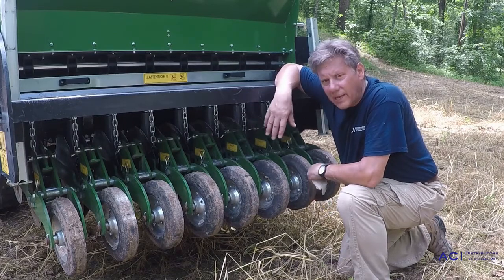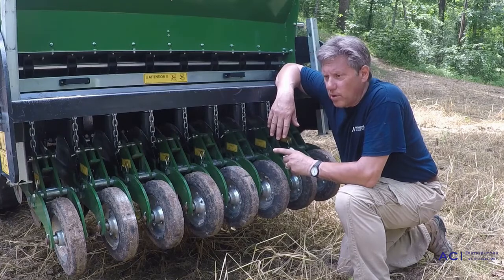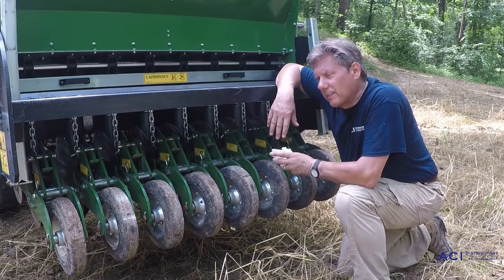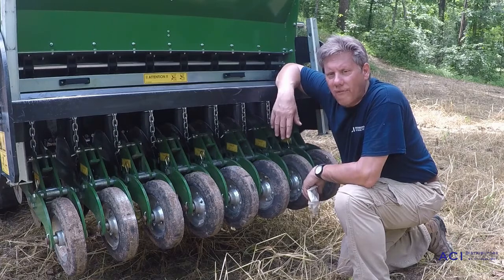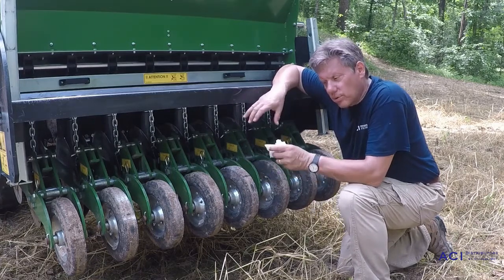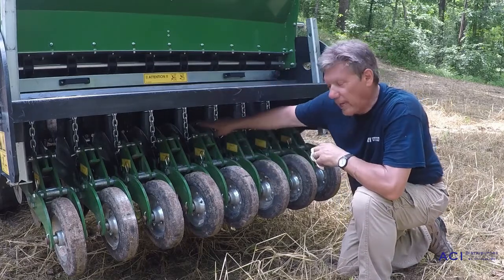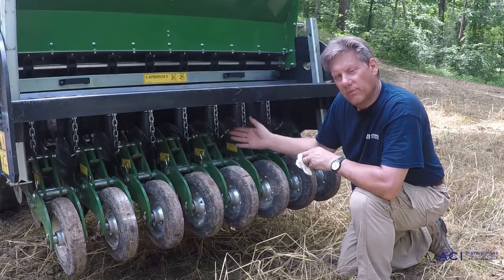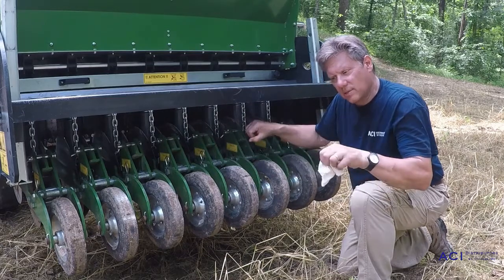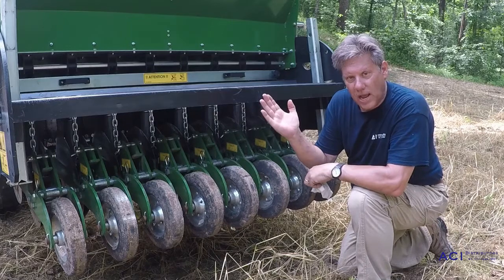But this does not guarantee the depth in which you're going to plant. With the soybeans and the sunflowers needing to be a little deeper than the other two seeds, we're going to start off at the half inch depth. Our other adjustment is the top link. We shorten the top link to rock the front of the machine down, which means our planting coulters will go deeper. If we want to go a little shallower, we extend the top link, which rocks the machine back and brings us up a little shallower.